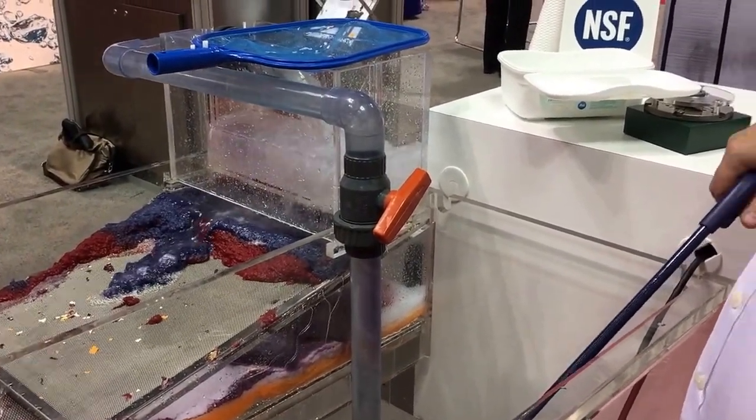Where you use this is traditionally where you might have used a sewage ejector in the past, but maybe you're having some clogging issues. What we found over the last couple years is that as more and more low-flow products become prevalent in the industry, you have less water going in but the same amount of sewage. So it became harder and harder for some sewage ejectors. If you start throwing stuff down the toilet that maybe you're not supposed to, that's where you run into problems — and that's where this pump comes into play. You would put this pump in where that sewage ejector would go, and it would grind up anything into small particulate, including hygiene products.